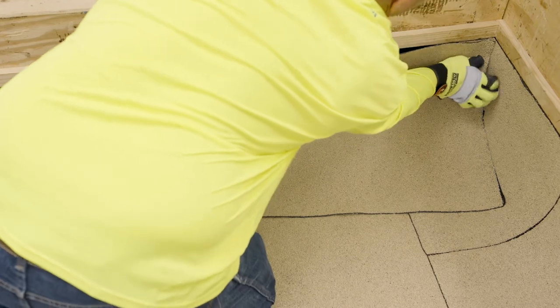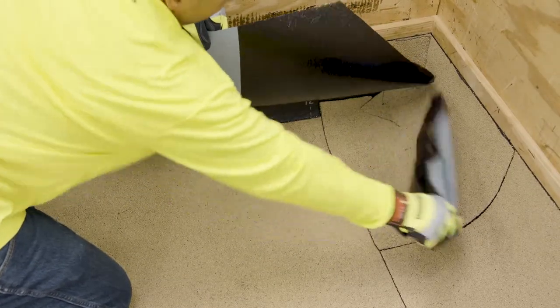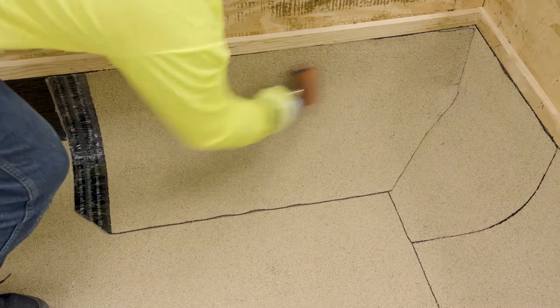The adjoining piece of cap flashing should be set flush into the corner and mitered to meet the preceding flashing piece. Remove the release film and roll in place in a similar manner as the first piece of cap flashing.